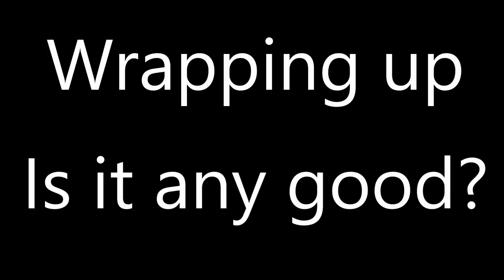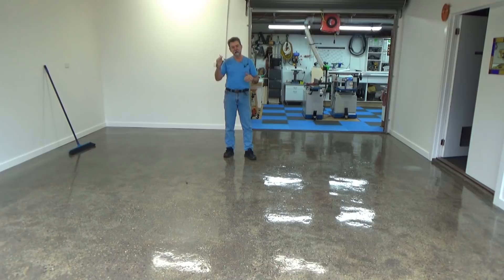It's been two months since I painted the floor with epoxy and I can give you some feedback on how it's handling normal wear and a little bit of abuse. Three weeks after painting, we had a 21st birthday party, it poured down rain outside so a lot of people came into this room. We had chairs everywhere — timber chairs with felt bases and metal folding deck chairs. Those chairs combined with people who had drunk too much alcohol did tend to scratch the floor. But then with vehicles driving in and out, the floor seemed to magically repair itself. I'm guessing the sharp edges of the cuts into the epoxy were slowly worn down — it's just like giving it a bit of a polish. In hindsight, I'm happy those scratches actually went in there.